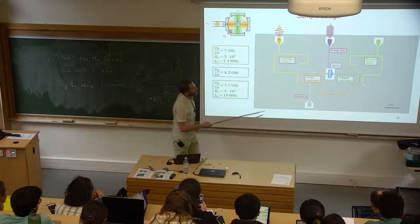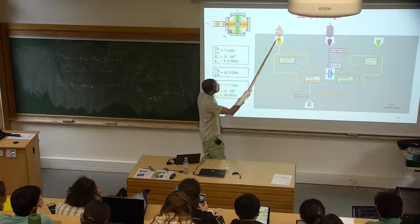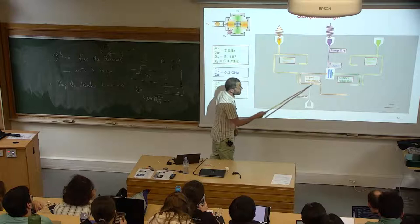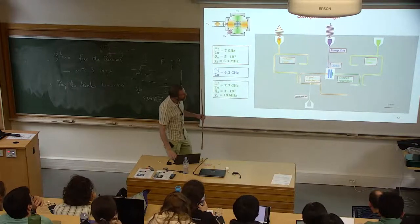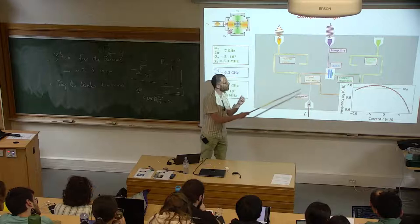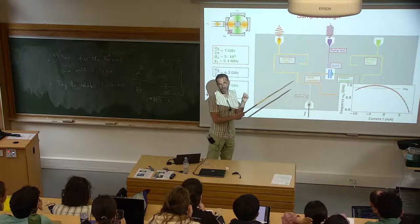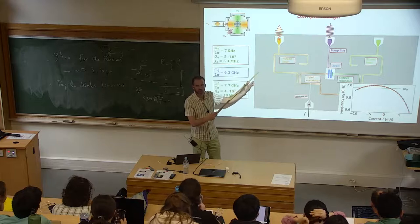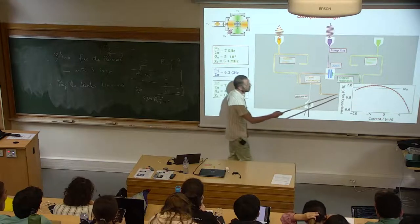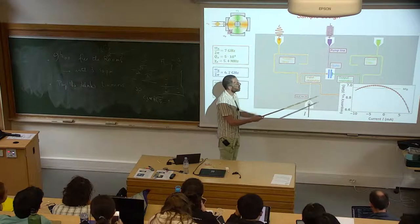And this is the device design. Maybe I won't enter too much into details for the experts. The qubit is coupled... this is the input photons. The input resonator is coupled to the line via a Purcell filter, and importantly, we can tune the input resonator. This is actually important. Here, this is a detector, and the detector frequency is fixed by the frequency of this resonator. So it is important that we can tune this resonator to the frequency that we are interested in, because this is fixed by another device that is far away in the fridge. We do this by having a SQUID in the input resonator, and we can tune it over, again, a few hundred megahertz. So this means that for any photon source in this area, we should be able to tune the detector to detect it.